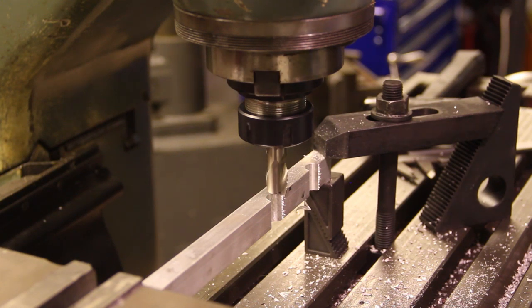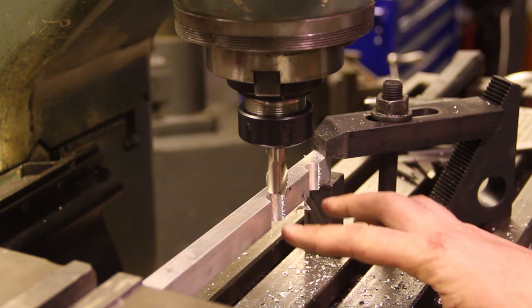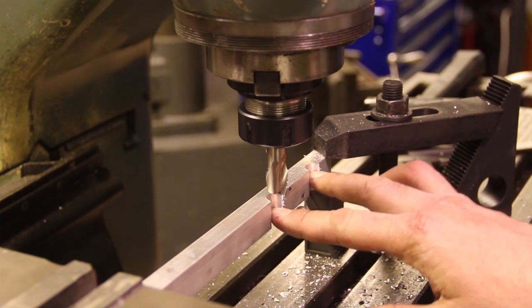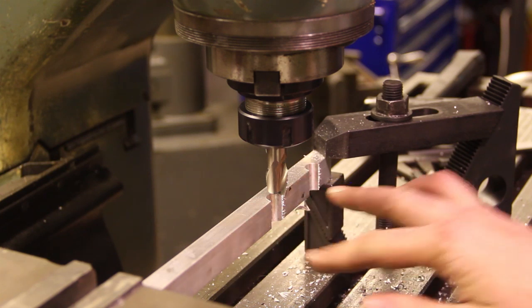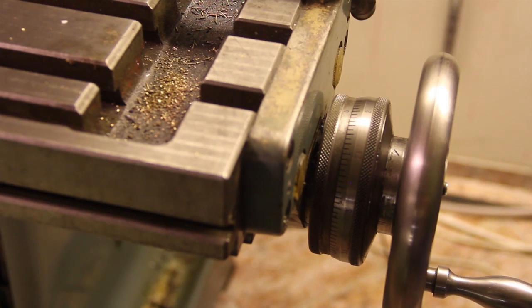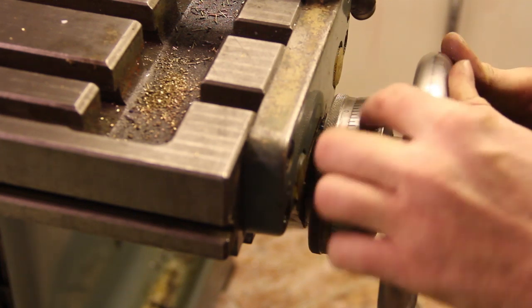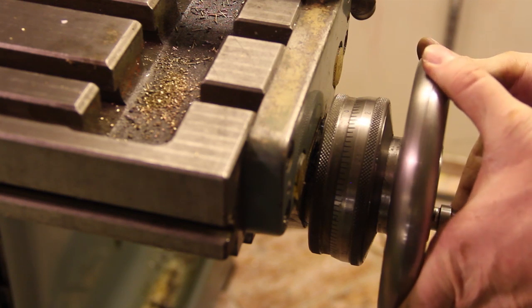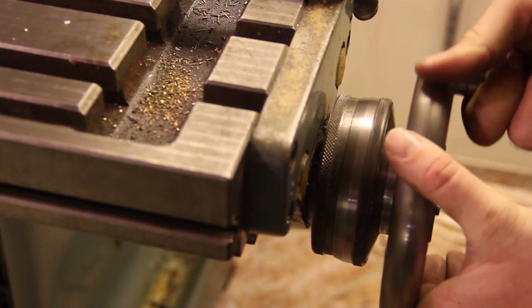As you can see, we made the first 2 cutouts, separated 60 millimeters for one of the parts. Now I'm going to crank the aluminum stock away farther to make the first hole for the next part. I don't have a DRO on this machine, so I just have to use these engraved scales here and sort of do it the old-fashioned way.